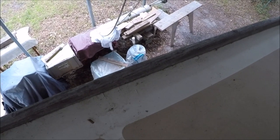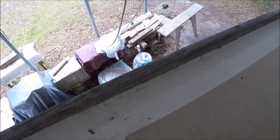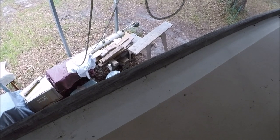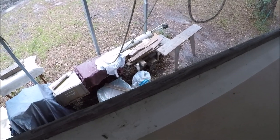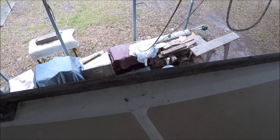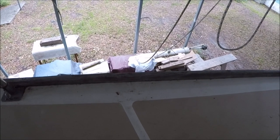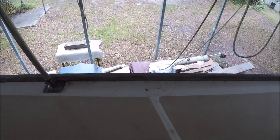Back to the toe rail question — there are leaks inside from somewhere on this toe rail and the rub rail outside that are getting in through the fastener holes or the hull-to-deck joint. At some point if the teak is bad enough it would have to come off and be repaired or replaced, but we're trying to avoid that because it's not in that bad a shape. It could use sanding and resealing, but getting all those bungs and screws out would be a really big job.